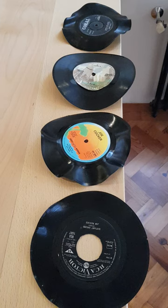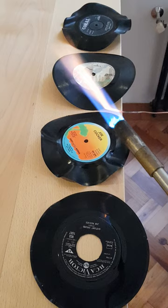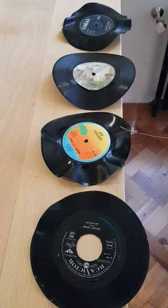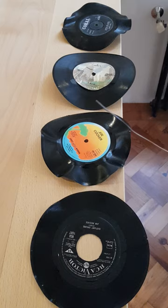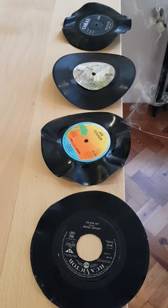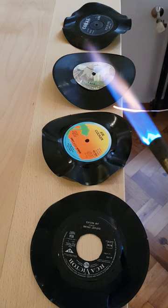So here we go. There will be quite a lot of noise from the blowtorch. I'll torch up the wire — you can get it really red hot. There is some colouring of the flame as the wire goes red hot but not a lot of colouring. So if I then rub that onto Joe Cocker, that will have smeared some PVC onto it, and this is where we see — there we go — classic green coming from it, and eventually it burns off and the green colour goes.